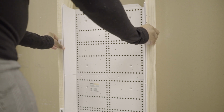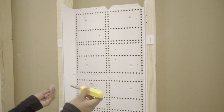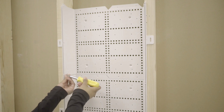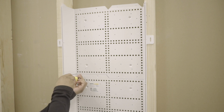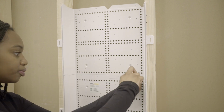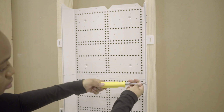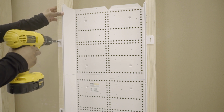Slide the next stackable enclosure box with no end cap installed onto the stackable enclosure box with knockout end cap. Secure the box together in 6 spaces using the included box screws with a Phillips head screwdriver. Screw the tabs into the studs with metal wood screws, not included, in order to provide more support for your cable bundles.